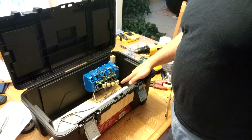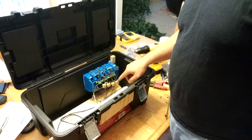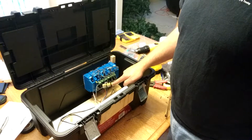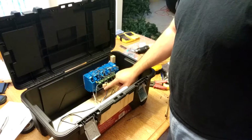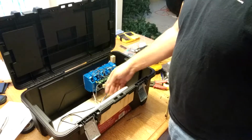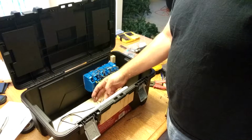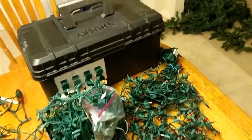Okay, so now we've put the push connectors on all the live wires to connect them all, and at the end we hooked a final black cord. Note we did little horseshoes between the push connectors to make sure that they all share the same live wire. Again, stripping them, these push connectors require that you strip them 1/2 inch, so make sure that they're all in place. And now we're going to take apart the power cord and attach the ground, neutral, and hot.